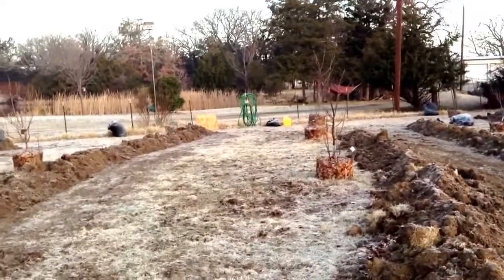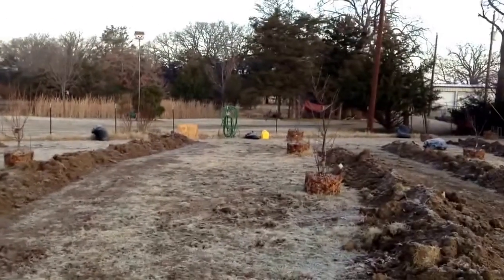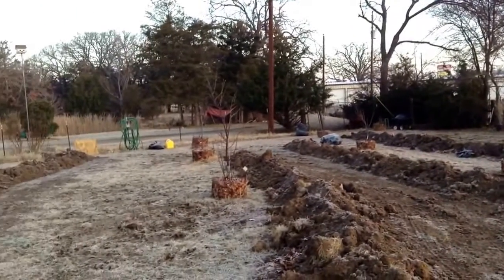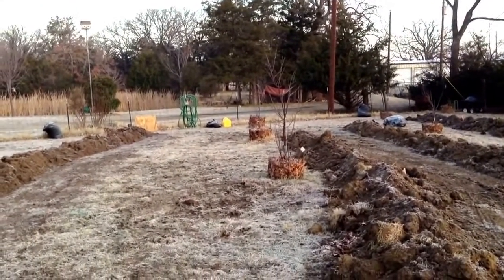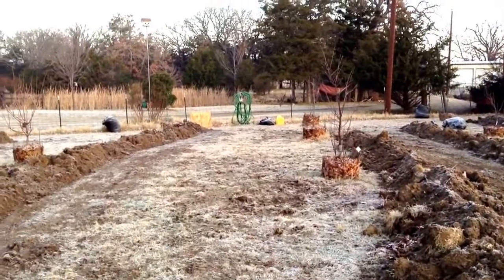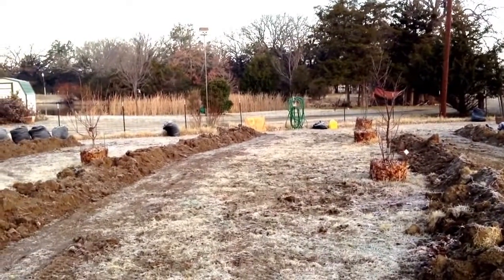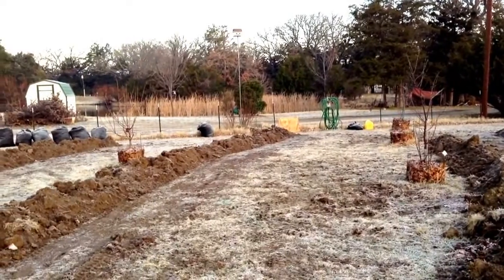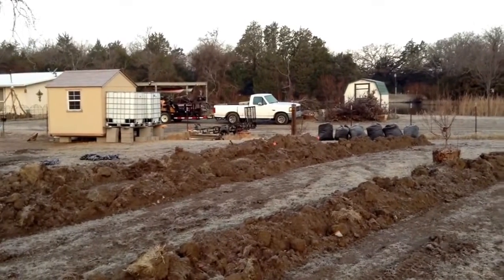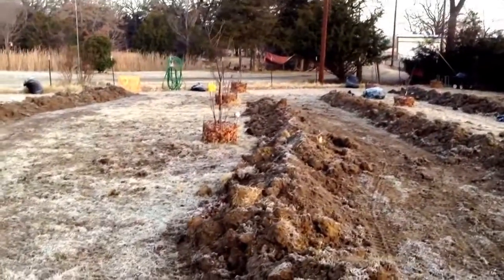They're all probably 18 inches deep — not the perfect dimensions I was hoping for, but I think they're going to work. They're all on the contour of the land here. I'm standing about on the crown — the property slopes down that way and then back over there where those trees are it slopes back down that way. I used a swing A-frame level and also built a 15-foot water tube level to determine the grade and measure the drop.